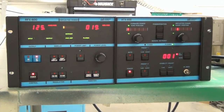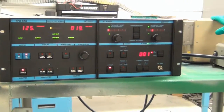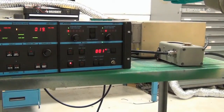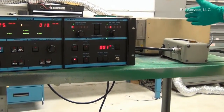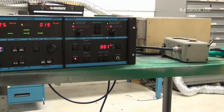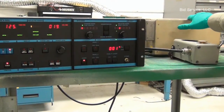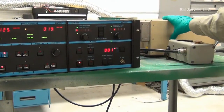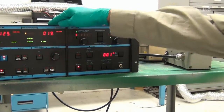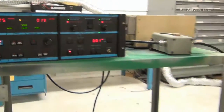The matching network is trying to simulate the chamber impedance matching. The chamber has capacitive, inductive, and resistive loads, depending on the dimensions and size of the electrodes, the chamber size, and the medium in the chamber — that is, the reactive gases used. Typically, the RF generator output is matched into a 50-ohm resistive load.